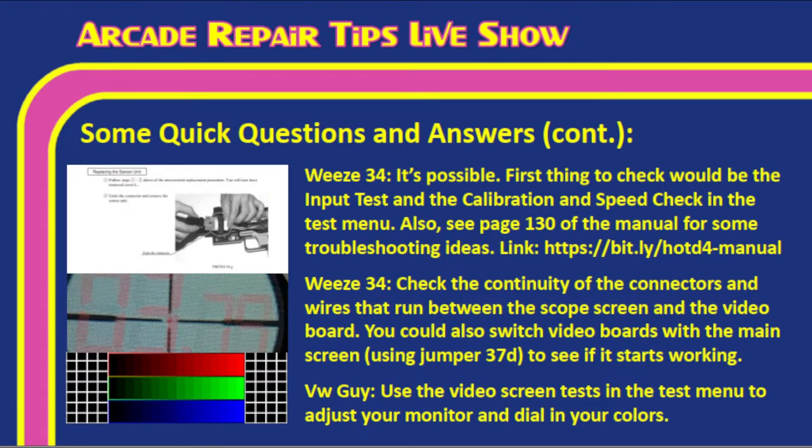So you can actually switch the video boards and basically the connectors. If you switch the connectors around and then you move jumper 37D, you can see if it starts. Basically, you get something on the scope screen, but now you don't have something on the main screen. If that's the case, then you probably have a video board issue of some sort. But if the problem basically stays the same, then you may actually have a screen issue.